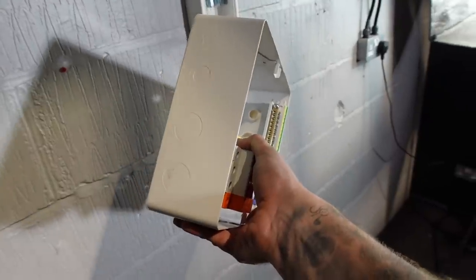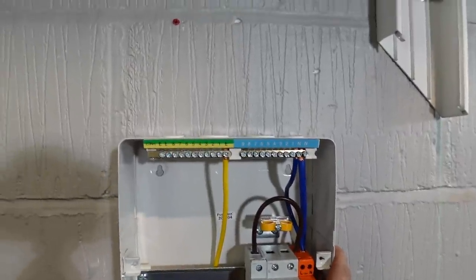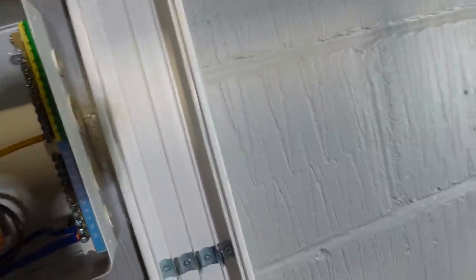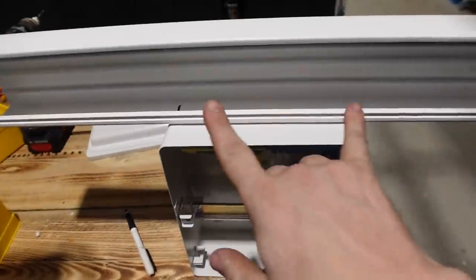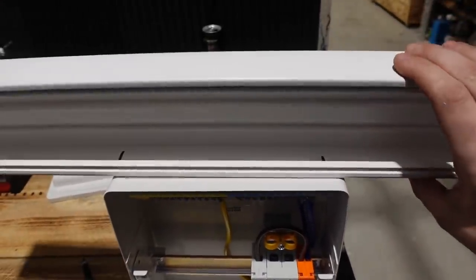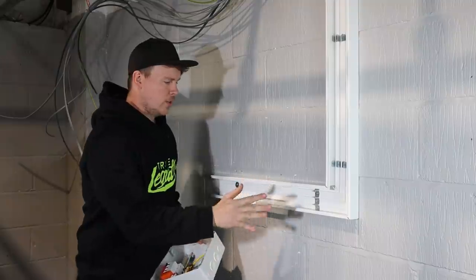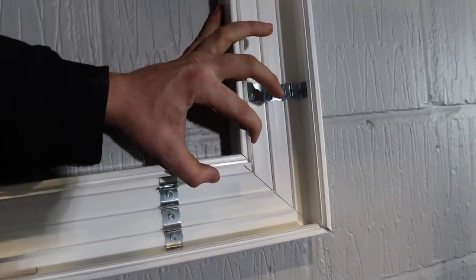Now I'm going to square across and get our bottom bit of trunking in. Because we want to leave access to the bottom of the fuseboard for our main tails and all the extra stuff, I'm going to mount the board underneath the trunking - so it'll sit here. To allow me to get into the grommets, we're going to open up the side of it. We'll place the grommets up against it and cut some notches at the top of the trunking to allow us to pass the cables through. So we're going to get a multi-tool and square out of there, which allows us to enter our five grommet strips. Trunking is in, we've got a slot cut out here for our board to fit onto. D-line clip, D-line clip - we've got the corner all made off.